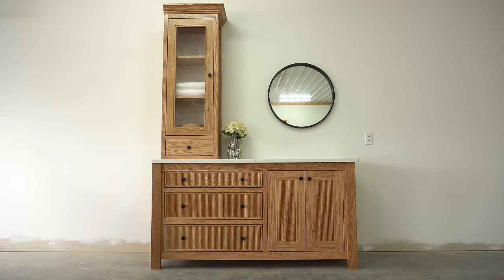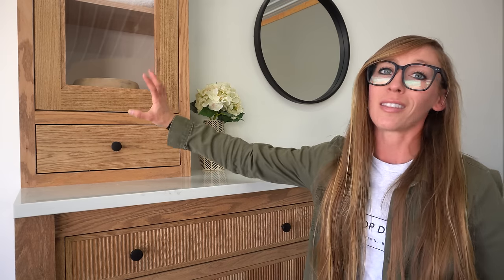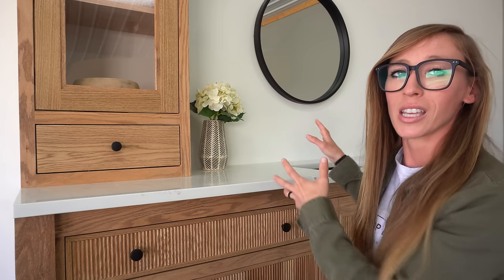And now this beauty is finally finished, and I am so excited with how it turned out. I'm not filming the installation because I still have work to do in that room — I'll need to tear out the closet, patch drywall and flooring, and paint first. Installation is simple: carry the base inside, set it in the corner, screw through the back supports into the wall studs, then set the countertop in place using construction adhesive designed for granite and stone. The upper cabinet sets on top just like it is now and secures to the wall stud through the top support. I bought my countertop custom cut from a local granite countertop supplier — most times they can cut bathroom countertops from a leftover piece on the lot, so it's fairly inexpensive, and for a custom off-center sink design this is really the best option.